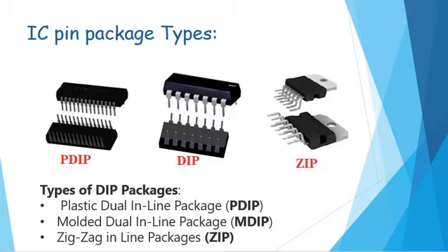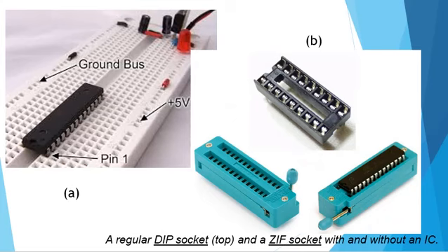Shrink type packages are smaller in size and use high pin density packaging. The last DIP type is the zigzag inline package, where pins are inserted perpendicularly to the circuit board and are perpendicularly aligned in the package and closer to each other. This sort of packaging was very short-lived and was mainly used in dynamic RAM chips.